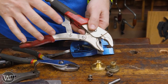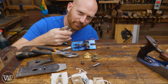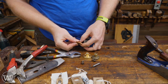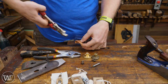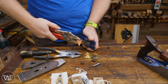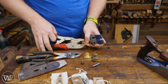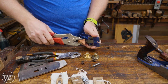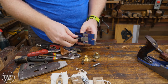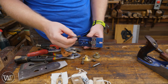Unfortunately, after two and a half hours of looking, I can't find mine, nor can I find my foot-powered hot glue gun to put them on. So my next favorite solution is just to grab a scrap piece of leather, wrap it around, and then I can use the vice grips to crimp down on that. And 99.9% of the time, that is enough. Because the yoke is in the way, I have to loosen it, move it, grab it again, and usually after two movements, it's now loose enough that I can come in here and unscrew it. Just make sure you go the right direction as they are left-handed screws and will drive you bonkers.